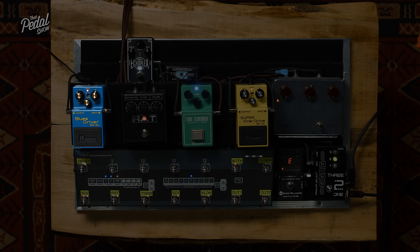So once you've got that increase in level, increase in gain, this is what happens inside every overdrive pedal, in the front, make it louder. You then need to create some overdrive from something. So how are we doing that? A really common way to do it, and we see it in all of these circuits, is with something called diodes.